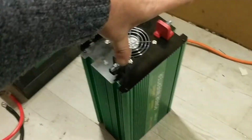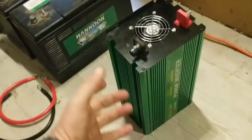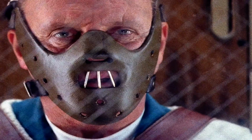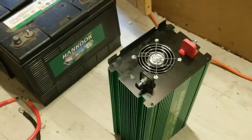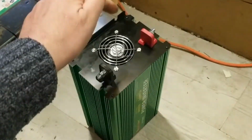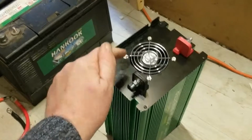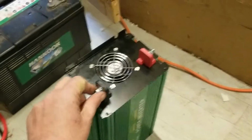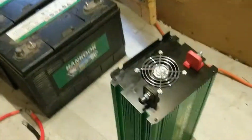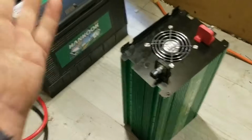But when you connect this to the battery, all them capacitors, which are hungry because they've been starved of juice for quite a while, go and try to suck power in as fast as possible. Now that, if you've got a lot of capacitors, can actually take out the fuses. And it's also not good to feed your capacitors that fast, because they kind of get bellyache and start to swell and expand. You've got to bring them up steady.